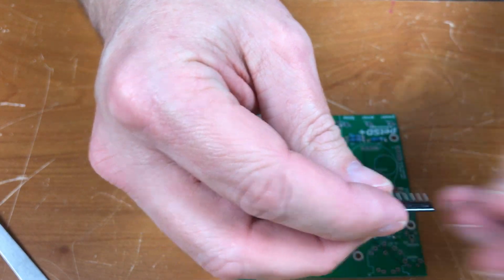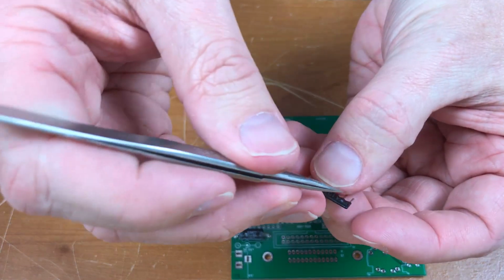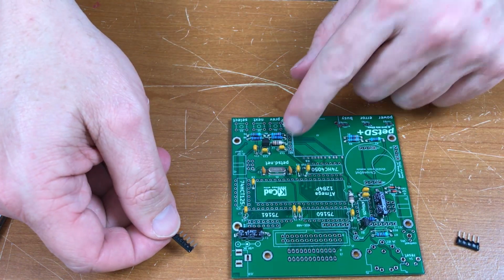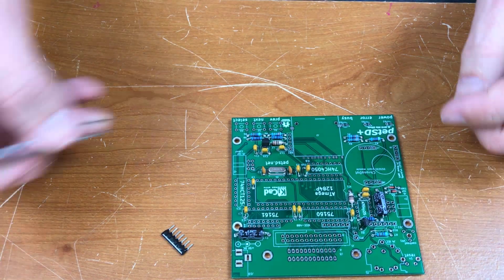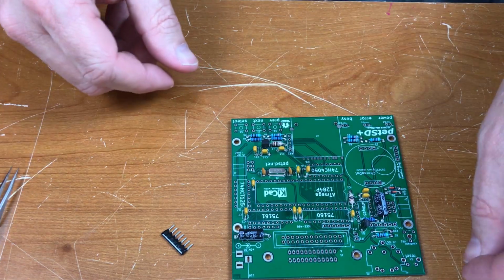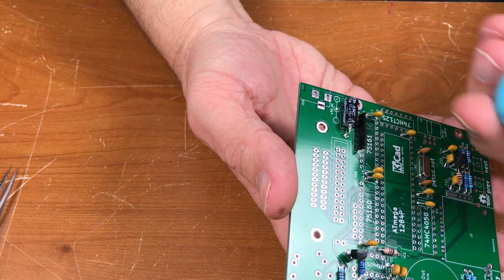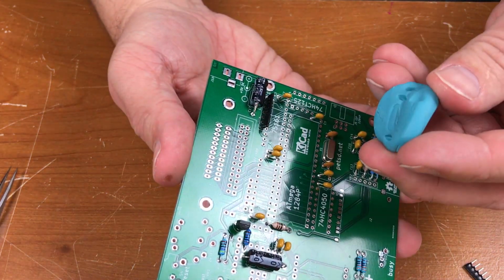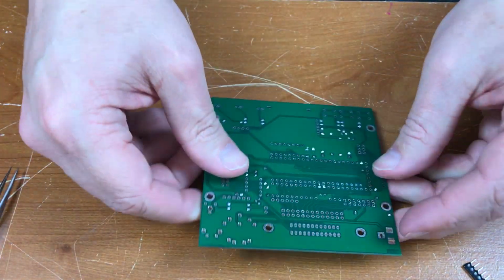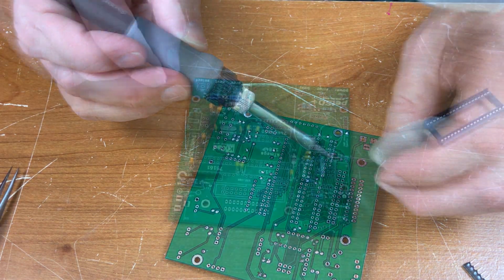This is a 6-position resistor pack and a 4-position resistor pack. And these have a dot on one end. So we just got to make sure the dot goes where the silkscreen indicates, which end is the common. RR1, the 6-position pack, goes up here. A wad of blue tack adhesive, like this, is good for holding components in place while you solder them. That's most of the discrete components.